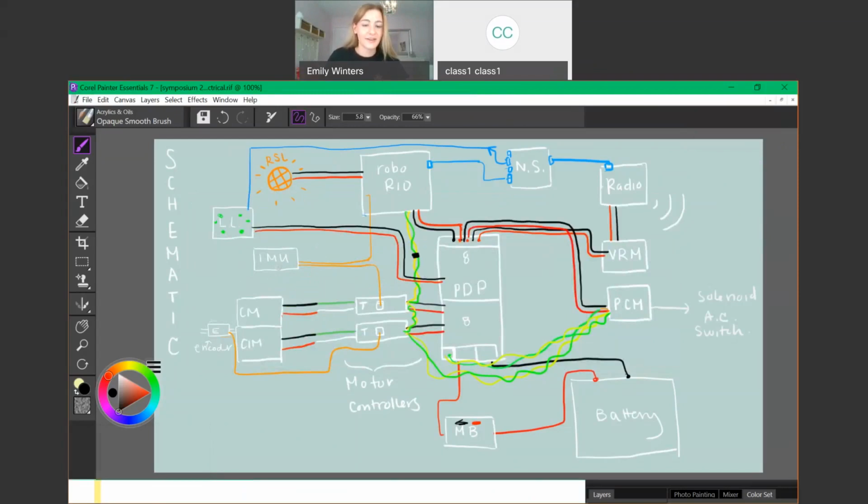And so the IMU and encoder are just two ways. The encoder can also have different uses. Let's say you had an arm you wanted to lift a certain amount each time. You could program it to move a specific number of ticks.